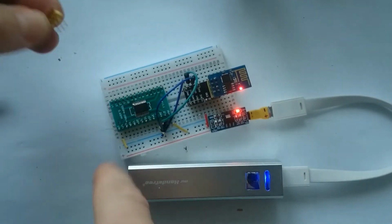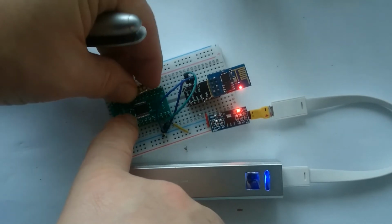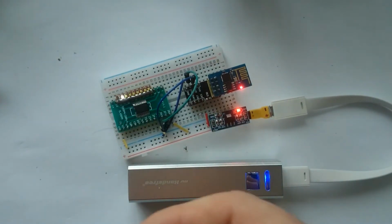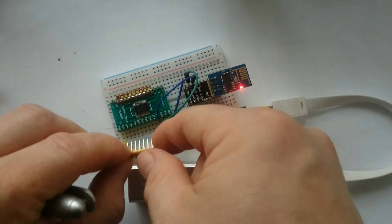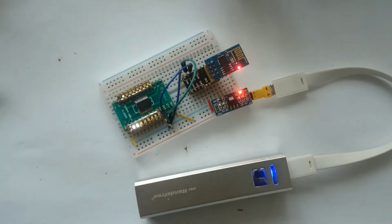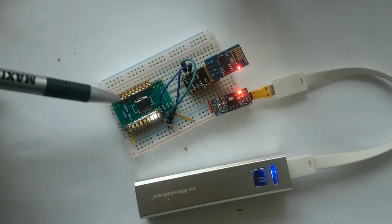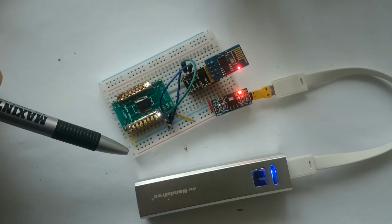As shown in the intro, these strips are quite handy to test the output of a device. Here you can see two of these strips used to show the output of a 16-bit I/O expander connected to an ESP-01. Just make sure to connect the pin with the resistor to ground. Also note that when connecting an LED to an input pin, it will usually light up dimly and it will pull the input pin down to ground.